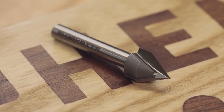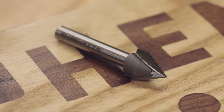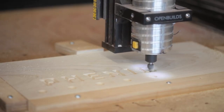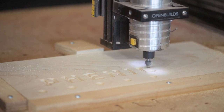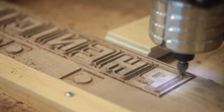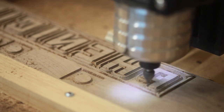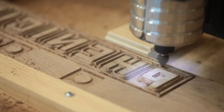Like the rest of this line of Shark bits, it has a quarter inch shank and is made of solid carbide. To create this type of inlay, I first cleared a pocket from my design into the maple board. Next, I cut a plug out of the reverse of the design from a thinner walnut board, which would later be glued into the pocket and then cut off and sanded flat.